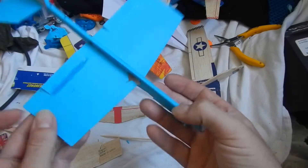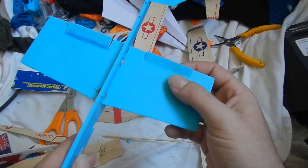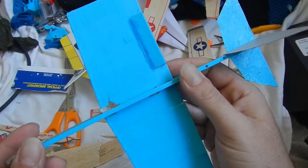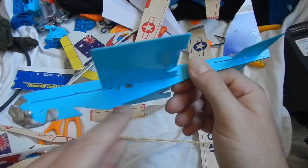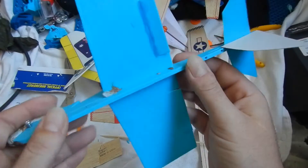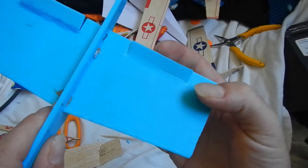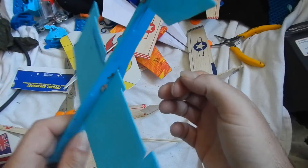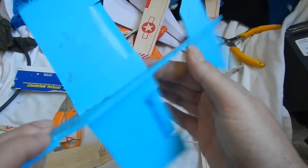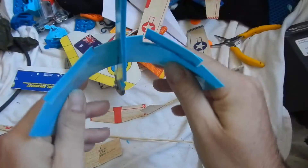These wings were actually designed by my nine-year-old daughter in FreeCAD in about half an hour to an hour. It didn't take her very long to learn FreeCAD well enough to make some wings — I was really, really impressed. It took me hours to learn how to make something as simple as that and she just picked it up really quick. I made the body with her watching and we talked about the measurements together, and after she saw how it was done she was really keen to have a go herself and whipped these up in no time. I had to help a little bit with putting in the slots at the back so we could fold the elevators up, and there are some flaws — you can see that one split and I had to glue it up with a bit of ABS juice. This is printed in ABS so it's very strong and flexible. Same with the wings — they really bend, no worries there.